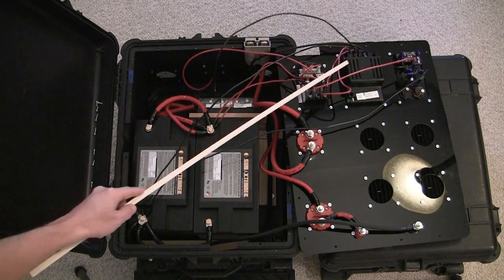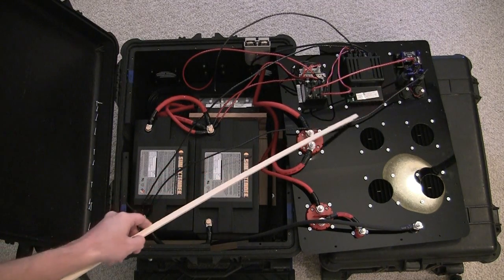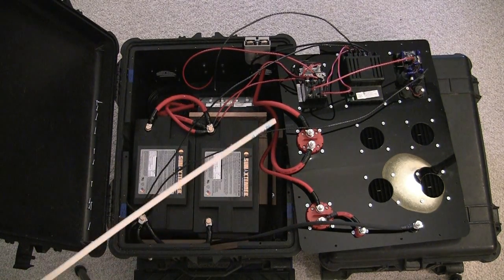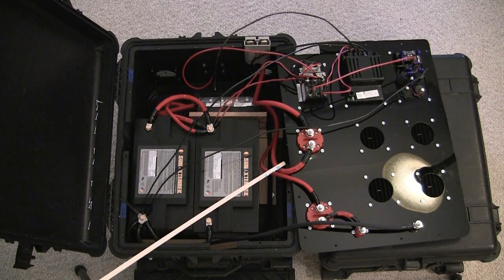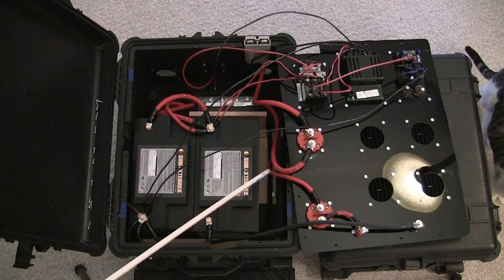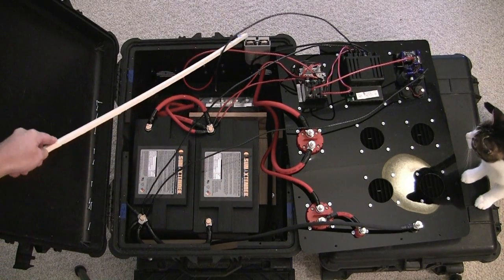Notice the gauge thickness on these wires is thinner because they're only expected to handle 30 amps — my solar panels are rated for 30 amps, my charger is 30 amps, and I should only be sending about 15 amps to the DC distribution panel, though the wire is rated up to 30. For the higher-current runs, you'll notice the wires get much thicker because you need to step up cable thickness with amperage. I have a website in the description that will automatically calculate the correct gauge based on cable distance and amperage draw.